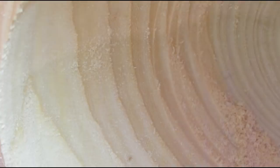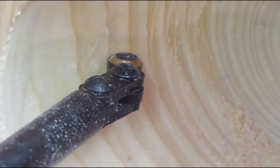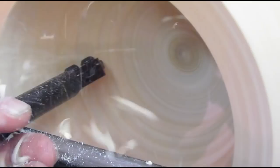Because we've angled the edge of the cutter over and we're slicing through the fibres, we're blending with the forces that are coming down. If we have the tool horizontal, then you've got a piece of metal meeting wood, and if the fibres can't cope with it, they'll just tear. So by rotating the tool over, we're blending with the downforce and cutting the wood how it wants to be cut — we're slicing it and we get a shaving. Letting the tool do the work.